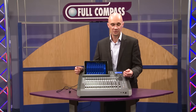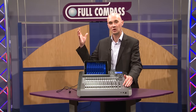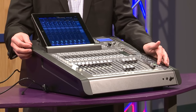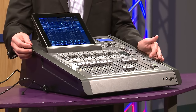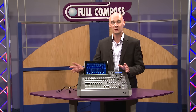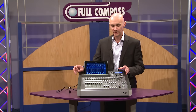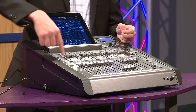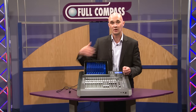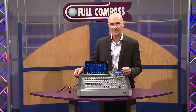One of the great things about vMixers and digital consoles in general is moving faders. All of the features from our professional higher-end vMixers — the M480 and the M300 — are built in here in the M200i. So you get moving faders, 300 scenes for recall, and incredible DSP on your channels. Your EQs are four-band fully parametric. You have a gate and a compressor, both with full key and filters available, as well as eight auxiliary outputs and four matrices. The matrices are full buses so you can route all of your channels to them, giving you a full 12 mixes in addition to your stereo left and right.